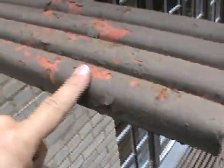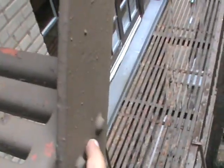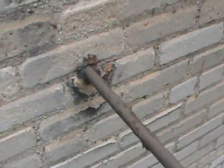So the boxes, let's talk about these treads. A lot of times by the time I get way down to the bottom, the treads keep getting worse. But right now, if these are in good connection, you just got to make sure this is all cleaned out. You got to follow EPA guidelines because of lead, and you put a 1/2 inch bolt in the middle of that. Seal this up and you bevel the caulking. Anything into the building, you got to seal it once it's repaired.